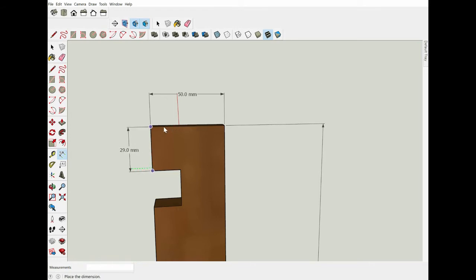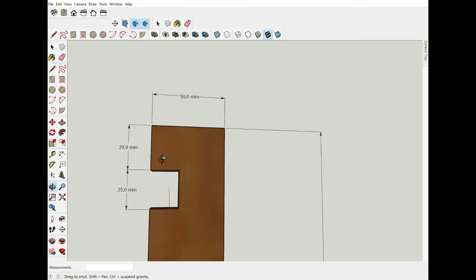This is a groove that I've got cut into the back of it. That's going to accept a tongue that's going to be holding up the French cleat. Now you can see that's a fairly big groove that I'm cutting out of there. That's an inch thick. So it's a fairly stout tongue that's getting put into the upright on this.